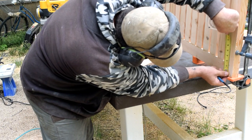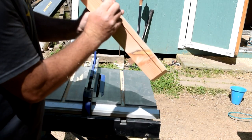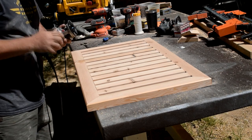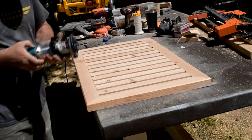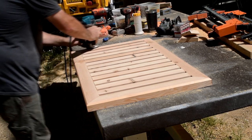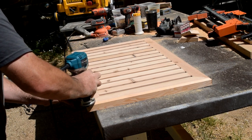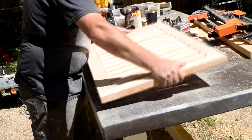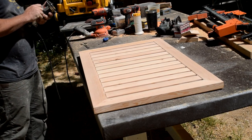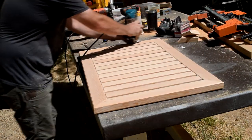Here I start figuring out where I want the legs to go underneath. I cut them at a 45 on each side. First I put a one-eighth inch channel in there for the Z-fasteners that hold the top down. I gave the bottom a pretty heavy chamfer — went around once just to prevent tear-out, then went pretty deep. I'm not sure exactly if it's a half inch or three quarter, but it's a good size chamfer. On the top side I gave it a one-eighth to quarter inch chamfer — so larger on the bottom, smaller on the top. The side skirt pieces are 17 and a half inch and the long pieces are 31 and a half inch, and both ends of those get 45s because the legs sit in at a 45.